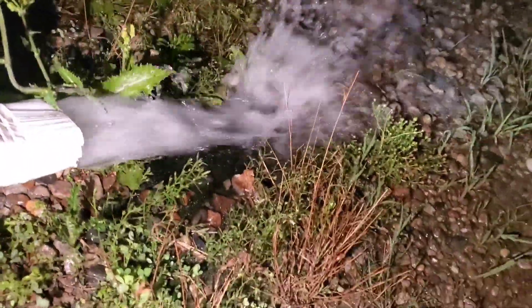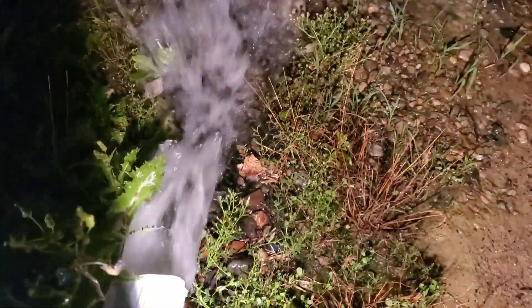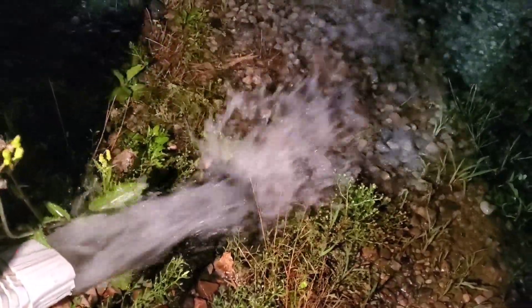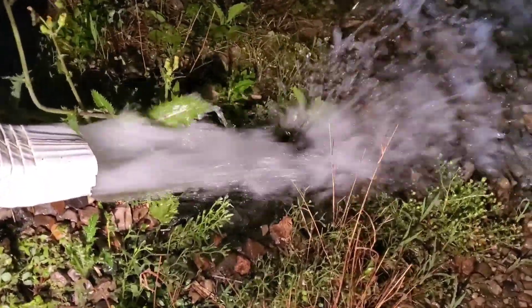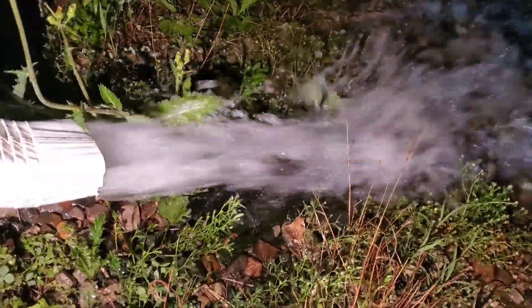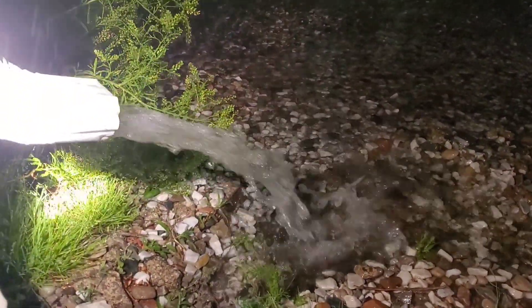The turbulence caused by those ridges in corrugated pipe — that's why I tell you corrugated pipe is self-cleaning. I've seen PVC pipe with its joints where people are gluing 90s, 60s, and 45-degree fittings. You have all these glue joints that come apart, then roots get in, dirt gets in, and when it cracks, dirt falls in. PVC doesn't build up the force or PSI that corrugated pipe does because it's smooth on the inside. That's why there are downspouts we put in 35 years ago working as good as the day we installed them.